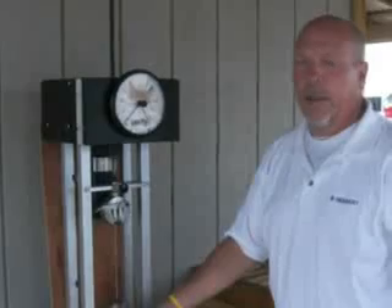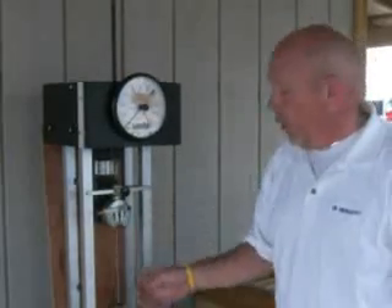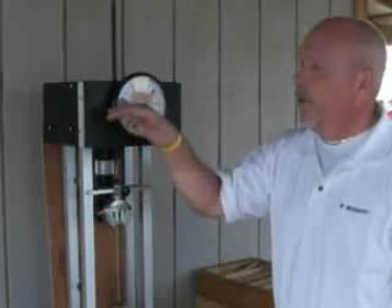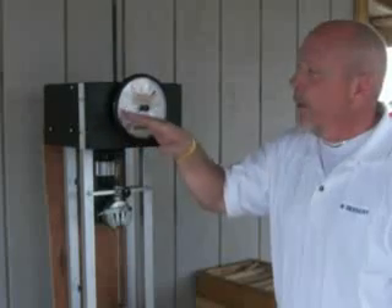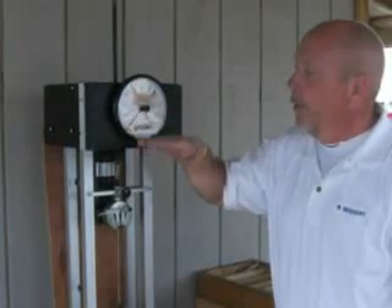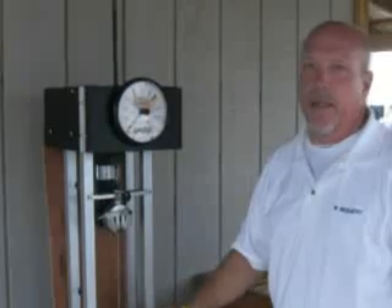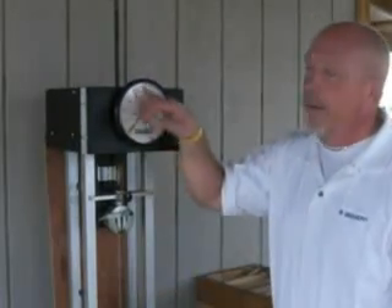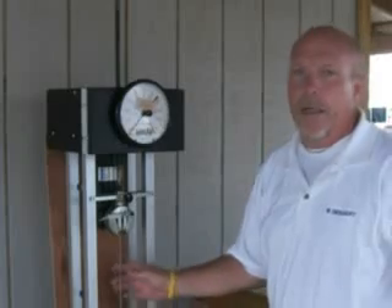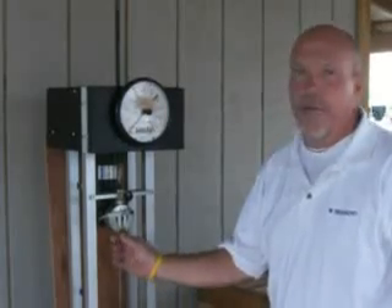What that translates to with the Cattleman barbed wire is a lighter yet stronger barbed wire that has no elongation. One thing you noticed with the low carbon wire was that when it hit its breaking strength the machine kind of stalled but kept pulling the wire apart — we have about an 11 percent elongation with the low carbon wire. But when we got our 800 pound break on the high tensile wire it pretty much broke right away. The high tensile wire typically has less than half of that 11 percent elongation.